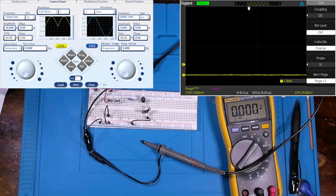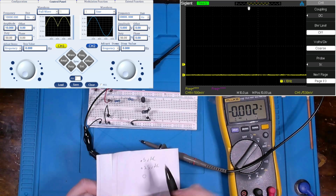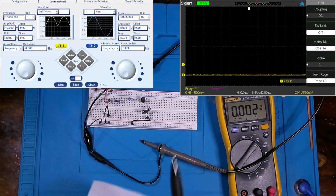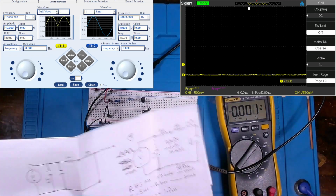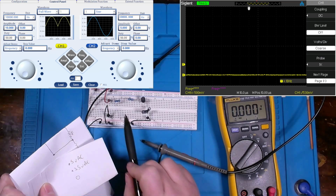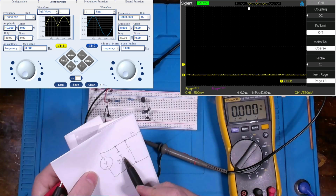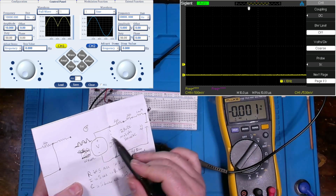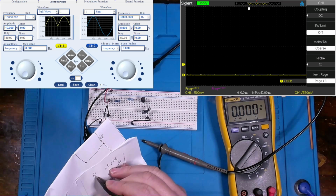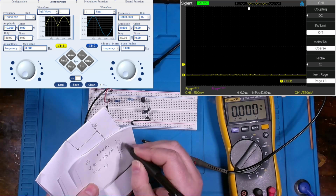So let's look again at our AC and DC components. On the first try, with no capacitor at our beginning stage here, we had 0.5 volts of ripple. After the voltage divider, 0.25 volts of ripple, and then none at the output. When we threw the 100 microfarad capacitor in at our beginning stage, we essentially eliminated that ripple across all 3 points: beginning, voltage divider, output stage. So all of these were 0. Okay.